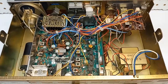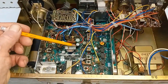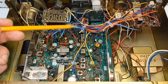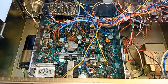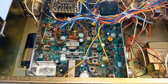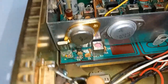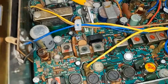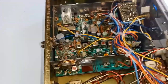For those wondering about the overall performance of the Realistic Navajo Pro Series, it just wouldn't be fair to assess that right now, as this radio is completely virgin with the 50-year-old electrolytic capacitors. I want to get those replaced, follow that up with a precision alignment, and then we can talk about performance. However, even with the 50-year-old capacitors, the locals tell me the transmitter's got some serious audio, and the receiver is definitely on par with top-shelf radios of the early 70s era. I should also say there's a darn good chance I'm going to hot-rod one of these Navajo Pros by upgrading the power supply circuit, installing a large voltage regulator transistor, allowing me to open up the modulator circuit. In doing so, I'm going to drop the dead key to darn near zero, upping the modulation a little bit, and feed a high-power RF final — I expect some serious swing in this thing.